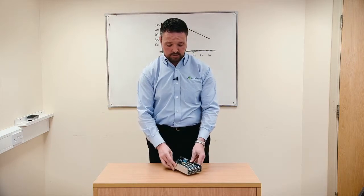Our design policies do not allow any component to go beyond 80% of its designed maximum temperature. So for example, for a FET, the maximum junction temperature is 150 degrees. Because we cannot measure the junction temperature directly, we measure the case temperature. We apply a thermal resistance calculation, and from that we can decide what the maximum junction temperature is in the application. So derating by 20% sets the maximum ambient in which it can be used.